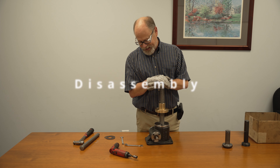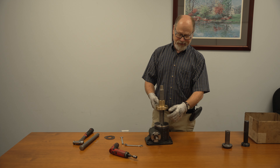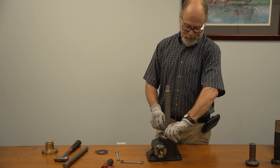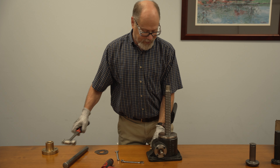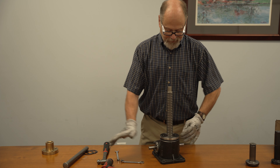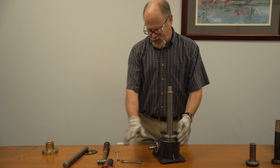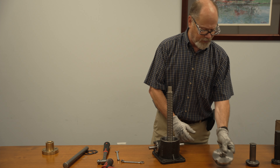Now we're going to disassemble our five-ton actuator rotating screw. So basically just take your lifting nut off. Of course the set screws lock down the shell cap — remove those. Normally we just tap the shell cap loose. There are different ways you can take this apart — you can take the flanges off first or the shell cap off first, it doesn't matter. So we'll go ahead and take that off.